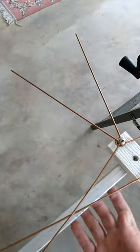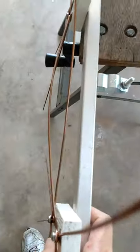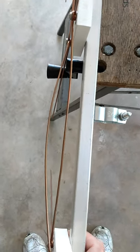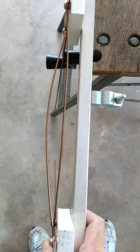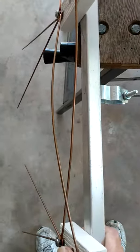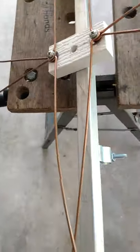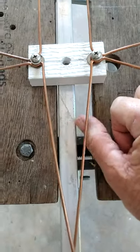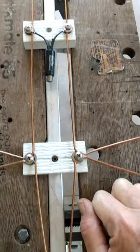One of the tricks I had to think about was keeping that lower phase line — this is the bridge, the crossover — away from the backbone material, because it's aluminum and I didn't want this to ground itself out. So I went more or less flat with the lower one and then bridged high over. You have to take that into consideration because if that lower line gets too close to an aluminum or any other metal backbone, it'll ground itself out or give you interference.